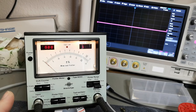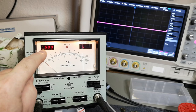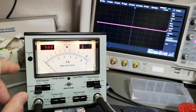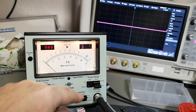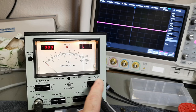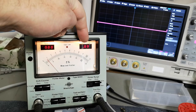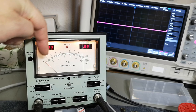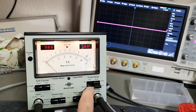Now it's actually measuring something that is accurate. We can select between two different standard frequencies — if we go to three kilohertz we of course have a constant drift error, but let's go back to the correct frequency of 3.15 kilohertz. The flutter range is now in manual range. You can also put it in auto range and then you'll see the range go to the finest range.